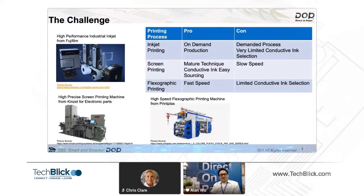First, we need to choose what kind of printing process to use. I've made a pros and cons list for your reference. For inkjet printing — it's excellent, it's on demand. In the morning my engineer designs a new antenna and circuit; in the afternoon my colleague can print it, assemble the chip, and run a test. So this is the best on-demand solution for printed electronics. The downside is that this process is very demanding, and also the conductivity is limited.